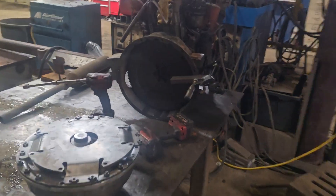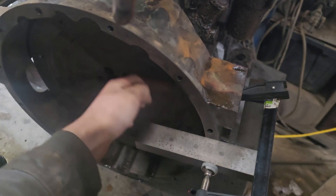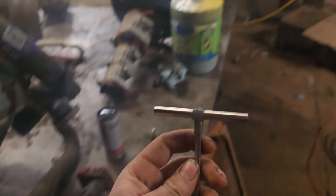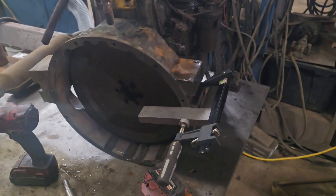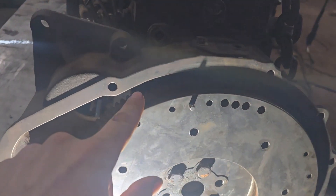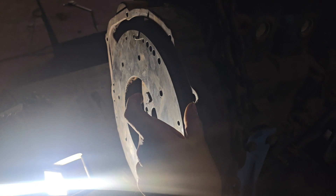This right here is the old engine. I got everything cleaned up and put back together. I need to pick up the distance from here to here. I was able to clamp a straight edge and then use a bore gauge to pick up that distance. It's not the best method — it'd be much better to use a proper depth gauge — but I'm working with what I have. It came out to about 2.56 inches, which is the thickness I need to make this adapter plate.